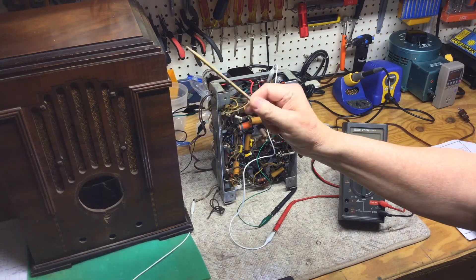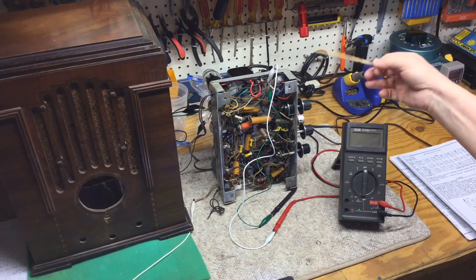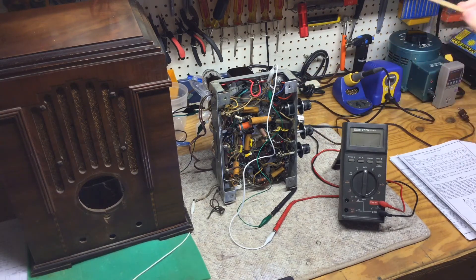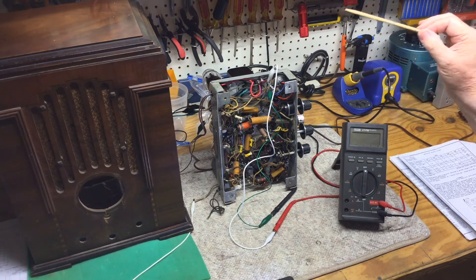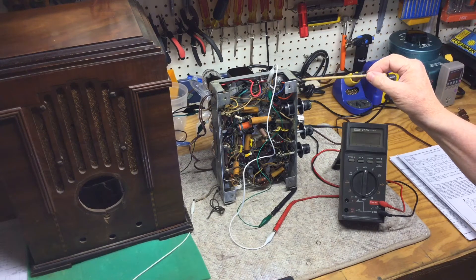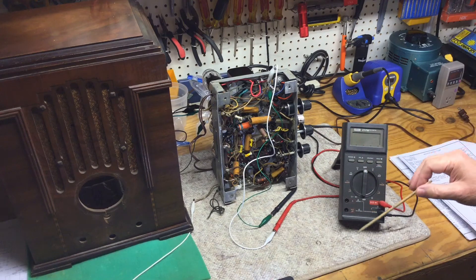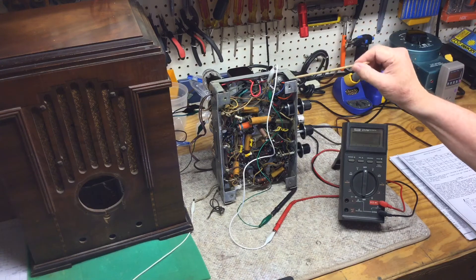This is the beautiful cabinet, and my dad is going to take this to the next level. I've been focused on this old chassis. In the last video, I took care of the rust removal on the front side, the top side, the tuning condenser, and the power transformer. I'm glad to say I have the tuning condenser remounted in the chassis. I got the grommets replaced, I got the power transformer reattached, and everything is electrically back in the chassis the way it should be. I also restuffed one of the two electrolytic cans.